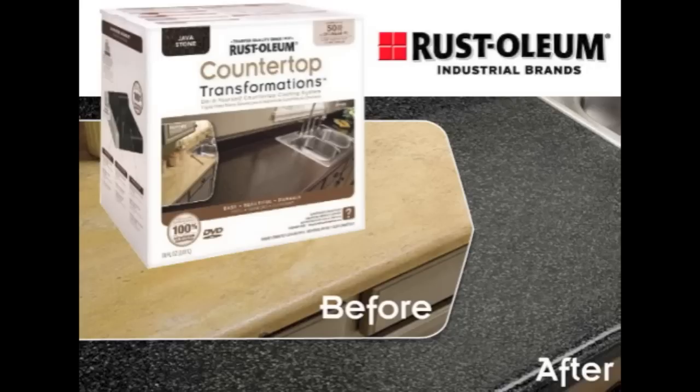On the tiling side — when I prepared the surface, put the gyprock on, and sanded the plaster after skimming it, I actually undercoated that as well and let it dry thoroughly, so that wall is then sealed. That will help prevent future moisture problems. You shouldn't really have moisture issues in a kitchen but it is an area that can have moisture, so that's just something extra I did.